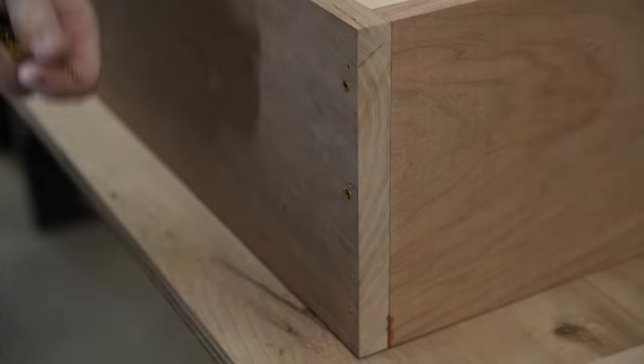I went with a 4-inch wide side casing. Now for the apron, again, I just used a 4-inch wide piece, and I just kept it about an inch and a half narrower than the stool on each side. So just take your stool length and subtract 3 inches, add about a 10 degree angle to the cut, and that's a nice looking apron, really easy.